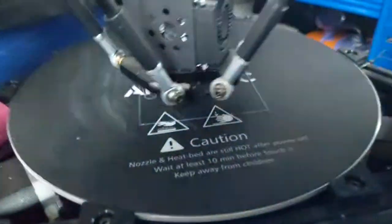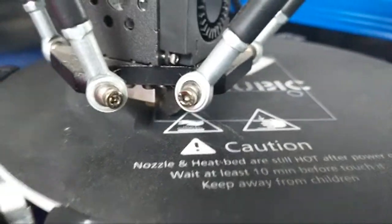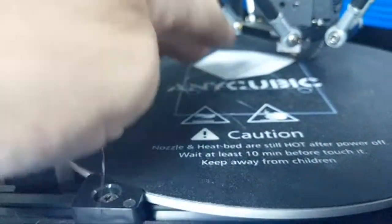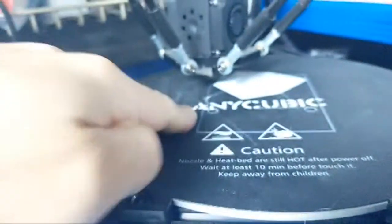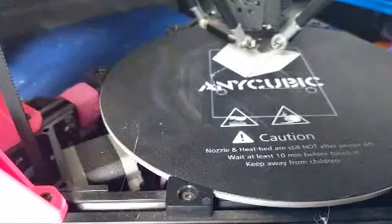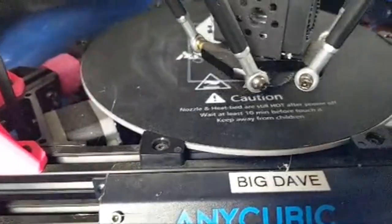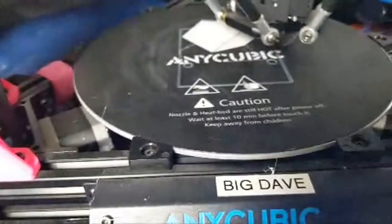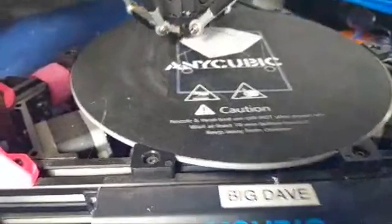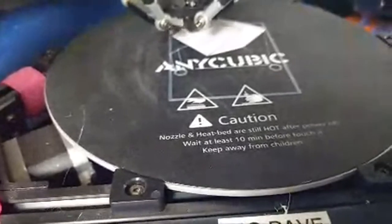So it did layer. It tries to lay the circles first. That's what it was doing. That's why it was a bit funky. That's better. Still got a bit of cat's whiskers going on. See, that's the problem. If we had that upside down, we wouldn't have to worry about that, just purely because the nozzles would be so busy printing loads of support material, it wouldn't be messing on this. This is a detail component we're printing now on the first layer.